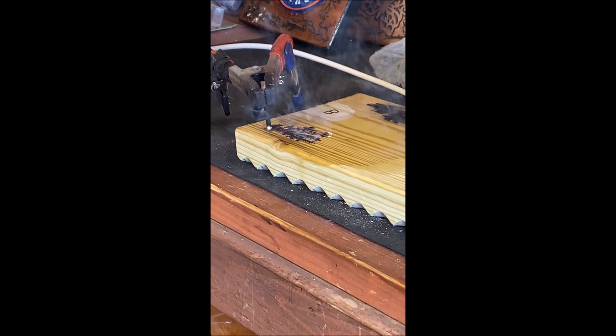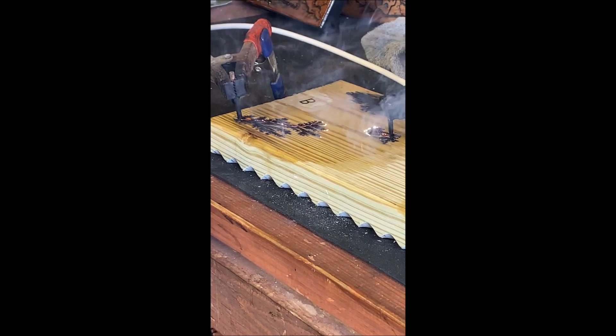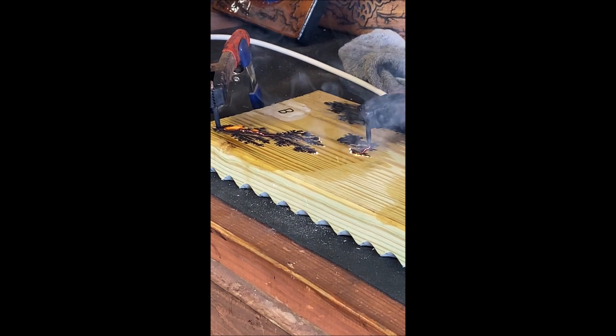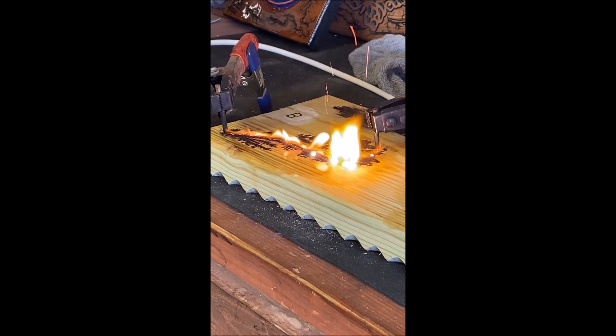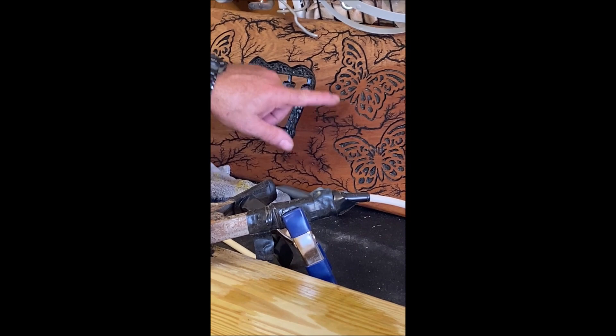Right now I'm at about 40 to 50 volts input, which means this is putting out about 500 volts AC. It's pretty cool — I could watch things burn all day long. You can kind of see the flame there, and that'll create a deeper burn rather than some of these smaller minor ones. I'm turning the power up and down — as the two burn paths touch each other it flames and creates a direct short. I'll sometimes leave that on a bit because I'm trying to get a deeper burn, a deeper groove.